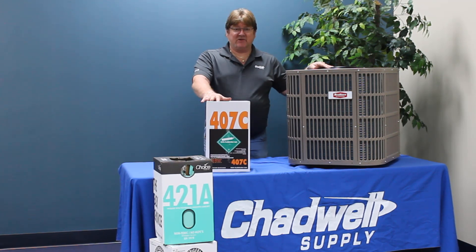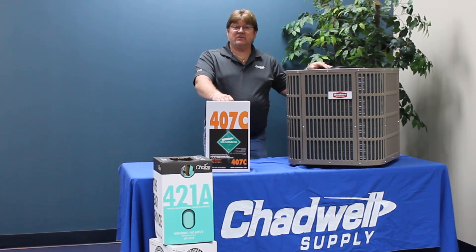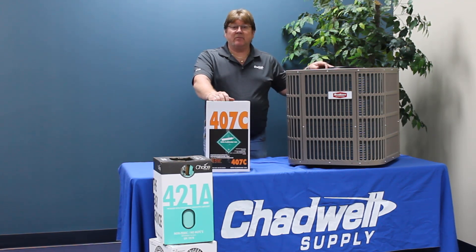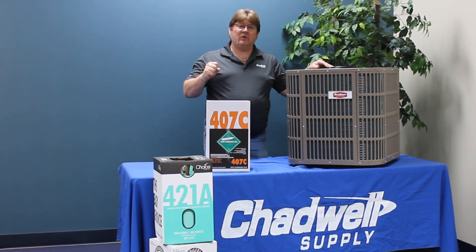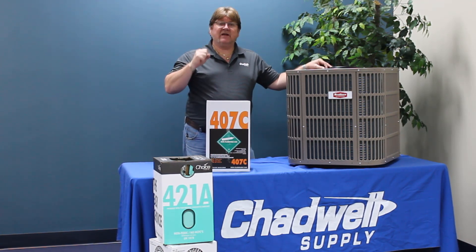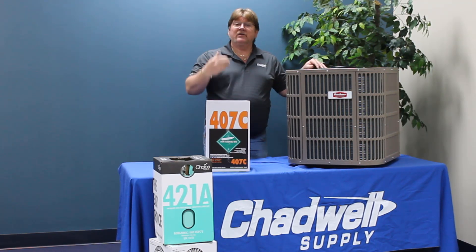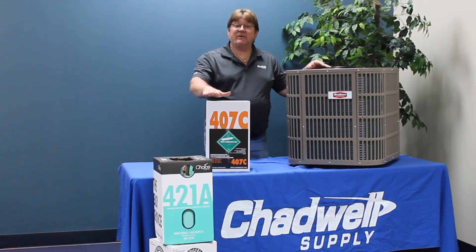407C is a retrofit replacement. I have to remove the refrigerant and the existing oil in the R22 system for it to be compatible. If I put 407C into an older R22 system with the mineral-based oils and alkylbenzene oils that are in the system, yes, it's going to work in the beginning. But what happens is the refrigerant picks up the oil and it's miscible with the oil at higher temperatures. When it hits the evaporator and the temperature gets lower, that cooler temperature drops the oil out and starts flooding the evaporator. The dry refrigerant returns to the compressor, picks up more oil, until eventually you end up getting a compressor failure a month or two months down the road — compressors dropping like flies because you're not doing the oil change.